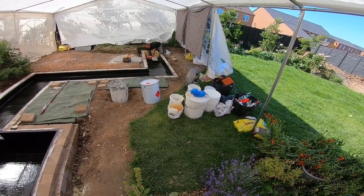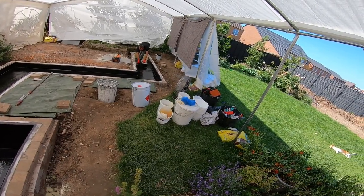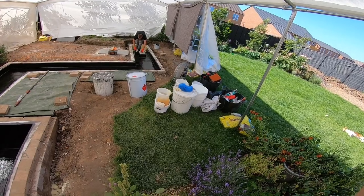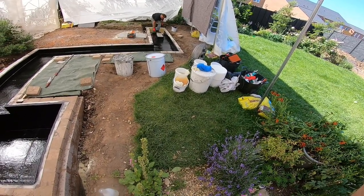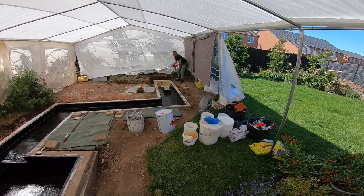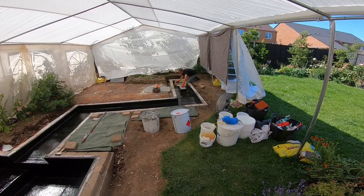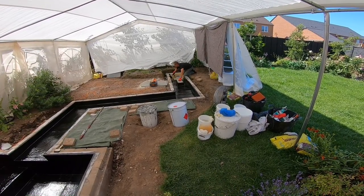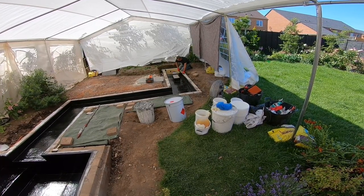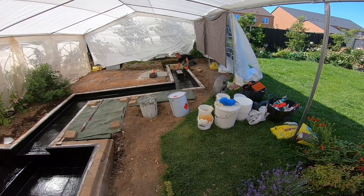There will be a little bit of flow coat left over — probably only about an inch and a half in the bottom of the bucket. I do like to have more rather than have to decant more from the tin, because there's a lot of heat generated and it will start setting anything new you put in straight away. There was a skip on the customer's drive and I asked politely if I could put that one bucket in it, because the stench that comes off it cooking in the confined space of a van is really, really nasty.